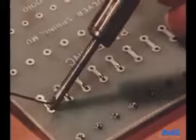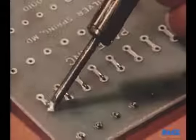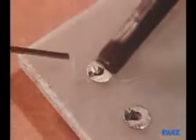Now we'll watch the soldering of the leads. Notice that the iron touches the joint first, coming in from one side, while the solder is brought in from the other. The tip is in contact with the lead, since this is the principal thermal mass in the joint. It's done with a light touch, so that no pressure is applied to the pad.